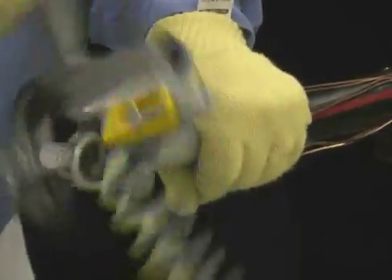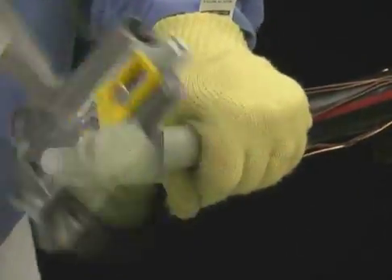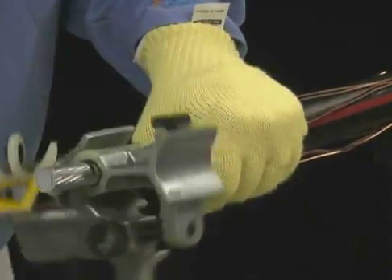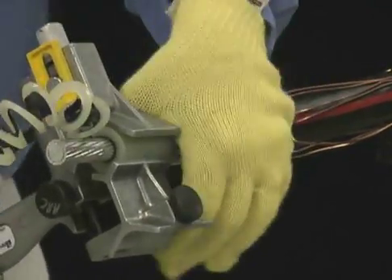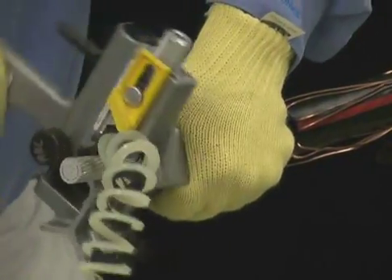Be sure that the blade of the tool is not making contact with the conductor below. Use a gloved hand to stop the tool from making a spiral cut and square off the cut at your mark. Spiral the insulation off the conductor and confirm your dimension.